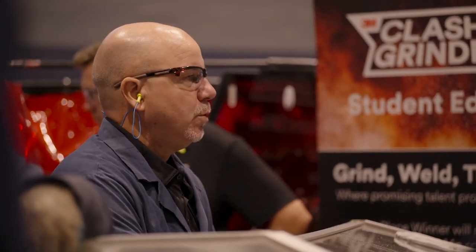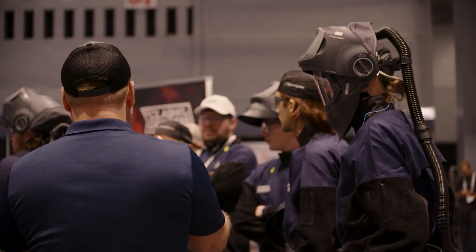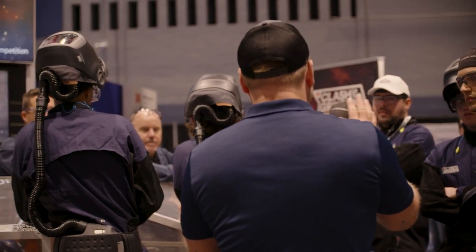You and your fellow 3M application engineer Tyler Natz provided safety training and gave students tips before each competition. What kinds of tips did you give them before this round? Well, as with anything, even seasoned veterans need to be reminded of how to run an abrasive product safely. And these students were no exception. Yours truly no exception. I have to be reminded myself. So we took them through some very basic handling of the tool, addressing the tool to the workpiece, how they stand, how they center their gravity, all those little things that play into effectively cutting the metal without gouging, having the wheel jerk away from them, or also even allow them to cut smoothly without having to put a lot of force on the tool.